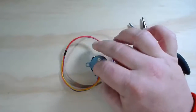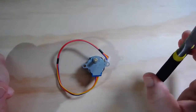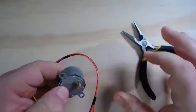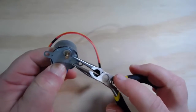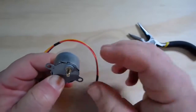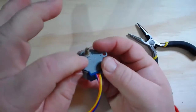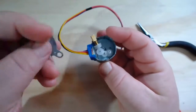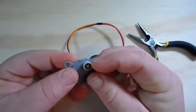What I really wanted to do is talk about the insides of this motor. I've already opened it — all I did was grab a pair of pliers and work on the four different tabs on the face of the stepper motor. If you give them a good pinch and pry back, you can eventually work those back. Once you do that, the faceplate with the motor shaft ought to just pull right off. The motor shaft dropped out, but you'll see it in there — it has a little plastic gear with some teeth on it.